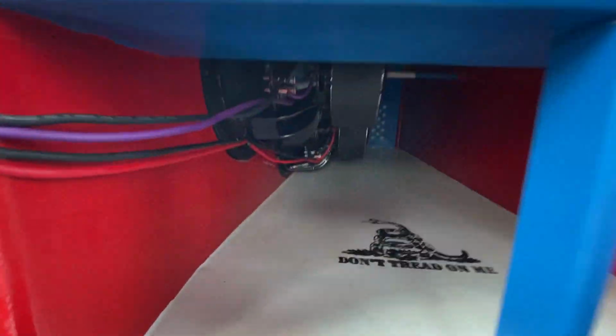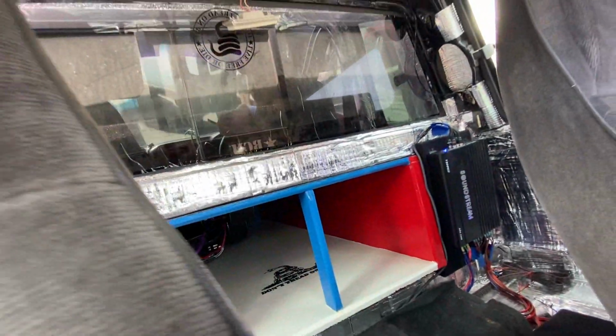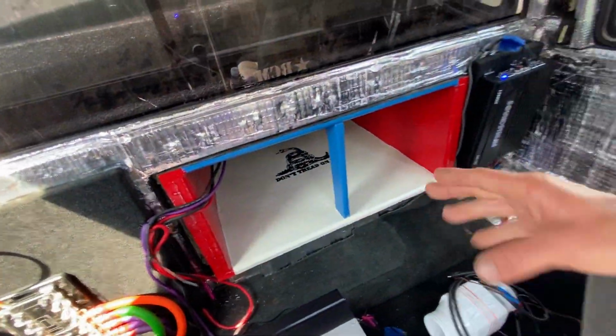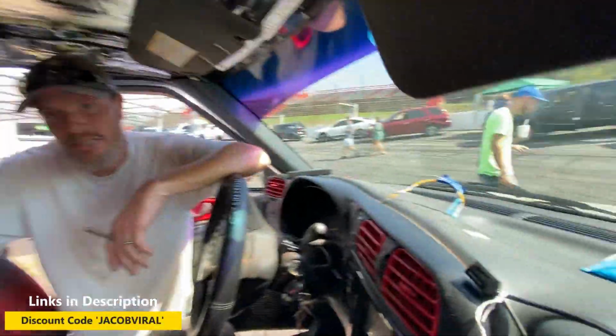I like the way you offset the box, so it went in here, and then you lift it up for more space. Well, it was the only way that I could get the port to fit in without interfering with the baffle. That's a good point. Because it's sealed on that side. So I could not get the port to go any further. I wanted to make the port shorter and wider. It just didn't work out.